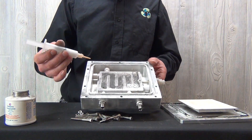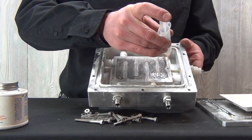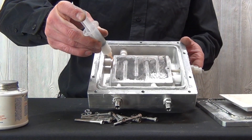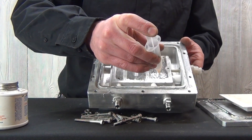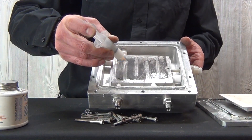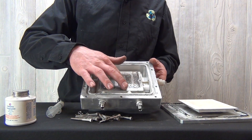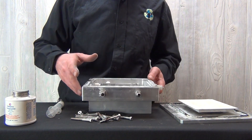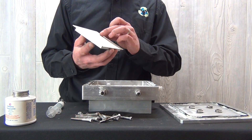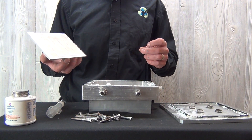When that is done, you can do the same thing on the sides. Take your ceramic sealing compound and put a very thin bead all the way around on the higher edge. If it's not smooth, you can smooth it out with your finger. Ensure everything is as clean as possible. I commonly will use a razor blade to clean off the ceramic so that it is completely clean prior to putting it back into the unit.